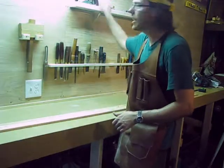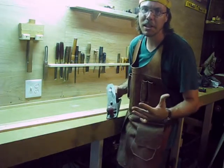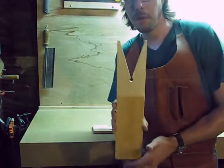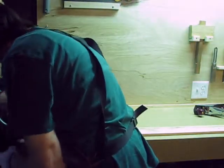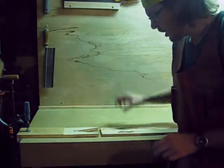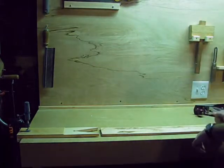Now I have my drawer stock. I'm going to clean that up just a little bit with the trusty smooth plane, and then I can measure the drawers more precisely and cross-cut everything to length. When you're doing hand planing like this, it's a good idea to have a bench hook — just a piece of board with a fork in it — so you can hook the board into it and plane onto it. Handier than a vise. You'll see these pitch pockets — you don't want those on your plane, so plane around those and go back and cut them off later.